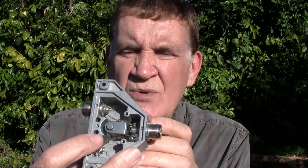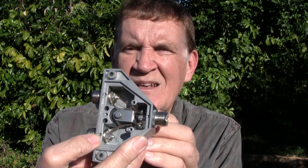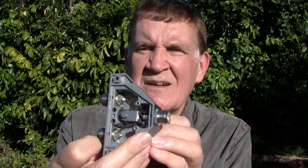Now one of the other things is this switch is now sitting in the middle. You'll see that both the rigs connected onto these two outlets are both earthed in the centre, which is excellent if you're going out for the day or not using your rig. Leave it sitting in the middle and it will earth both of the rigs connected to that.